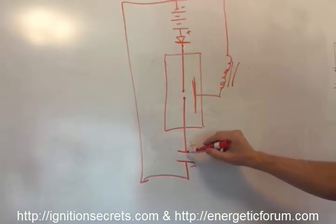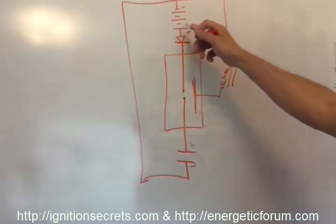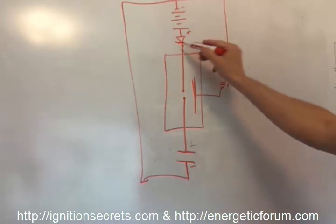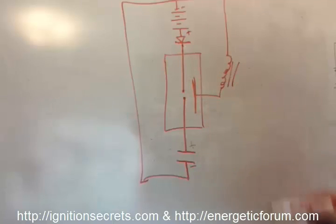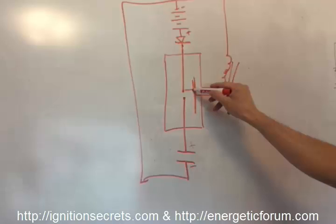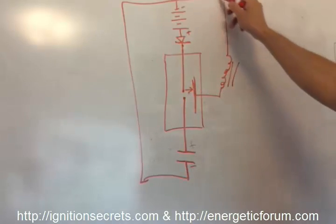Only a small bit of this discharge is going to be intercepted by the battery. That battery voltage will increase just for a little moment because it just got a huge bang to it. When this diode shuts off, the only other path to ground is over to the grids, through the inductor, and then back to ground.